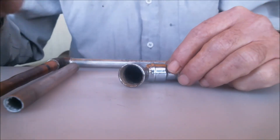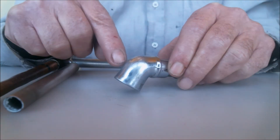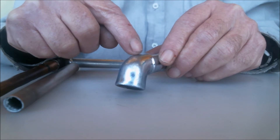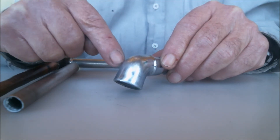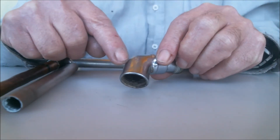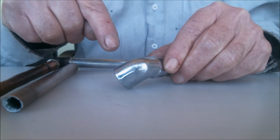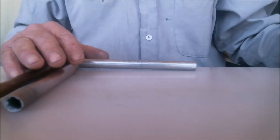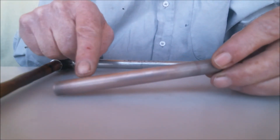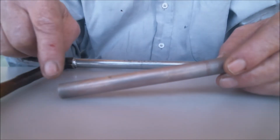These are my results with both tin plating methods. When tin plating a bronze fitting with the emergency method, the bronze colour is not visible anymore, and from a distance nobody will notice it was repaired. However, it's not perfect. The new plating is opaque and contrasts with the original luster if we look at it closely. With regard to the piping, we can see that the electrolytic method distributes the tin quite uniformly, but fails to deposit material on the ends.